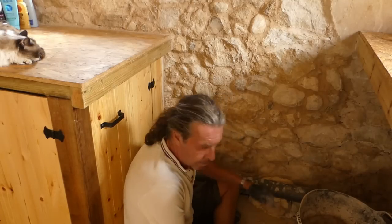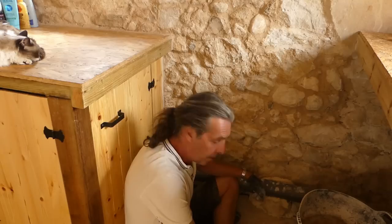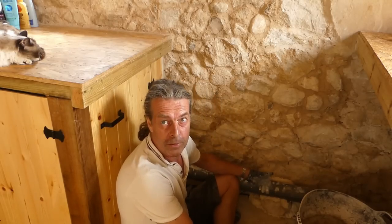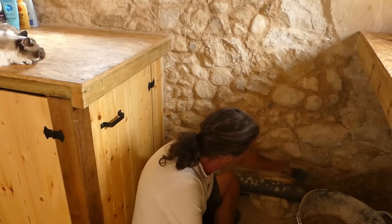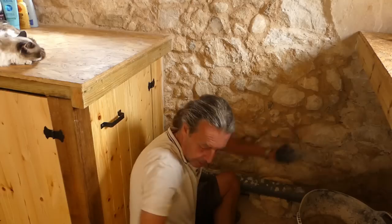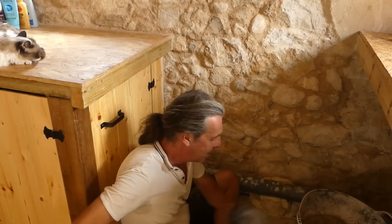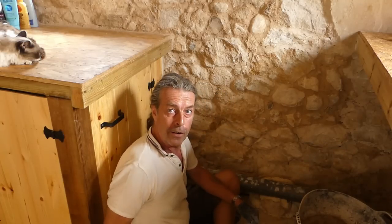In the meantime, we're back in position - get this wall finished, get this pointing finished off. In this room at least, only another six or seven to go, but at least there'll be another one ticked off. I've just got this bit at the bottom to do and then yeah, we're looking pretty good there. I've got a bucket of stones, my hammer to knock them in, my mortar - and I've forgotten to spray it down. So I'm just going to wet it down and carry on.